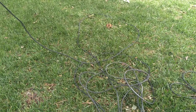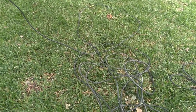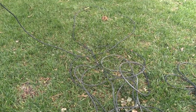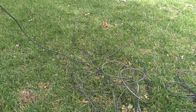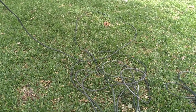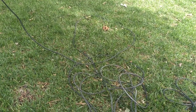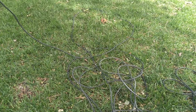Some people have small yards and cannot put up an 80 meter or 160 meter antenna. Check out my YouTube video — the 80 meter Z antenna. That'll get you an 80 meter antenna to fit into a 40 meter yard space, or you can put up a 160 meter antenna in a Z configuration that only takes the space an 80 meter dipole would take.